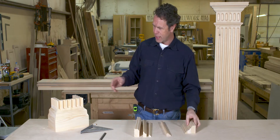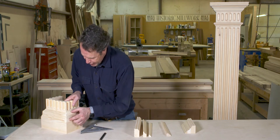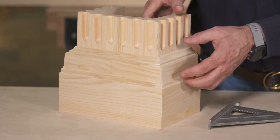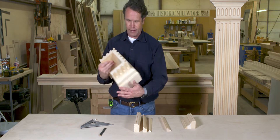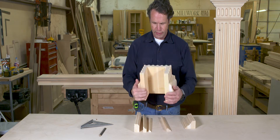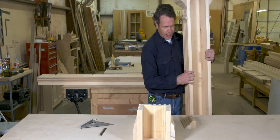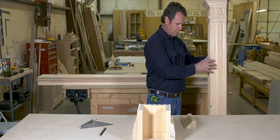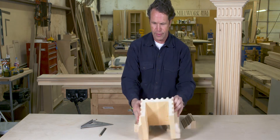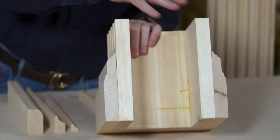He also does the same thing in the base. Our base has a plinth, and then it has this shaped molding where the torus would go, and he's kind of played around with things. This is a nice semblance because it gives you a picture of what this pilaster really is — it's a block. This is the back side of it. It looks much heavier and thicker than it is, but when we make these, we actually make them in three pieces of wood that are mitered together, and then our base is put on. So you're seeing the plinth, you're seeing the molding, and then our fluted pilaster.